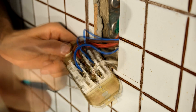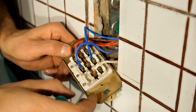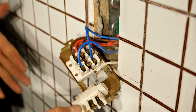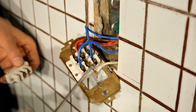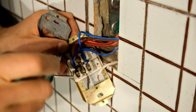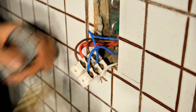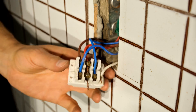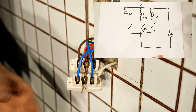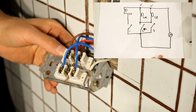That is my pantry light circuit. I can actually remove this light switch completely - I'm removing it and loosening the live wire. I no longer need this switch because the switch over here is going to do both lights - pantry and main. I'm going to make these vertical rather than horizontal. Towards the end of the video I have a tutorial explaining this in more detail with diagrams, so if you're not following just go to the end.